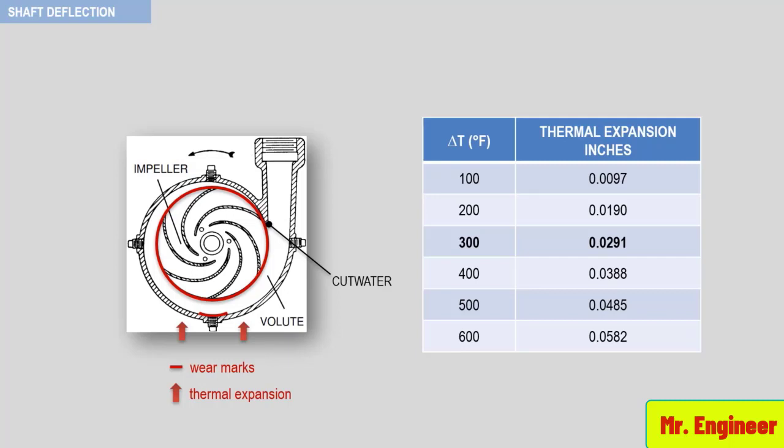You may even see the same evidence of wear around the circumference of strict tolerance rotary elements, leaving a corresponding spot on the stationary elements at any other point around the volute circle of the pump. This condition is probably misalignment, indicating a maintenance problem.